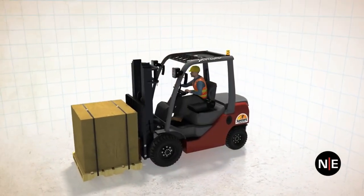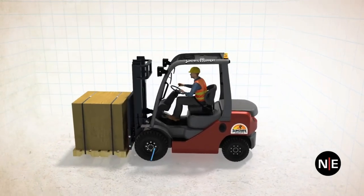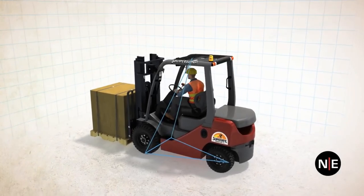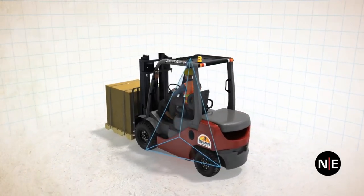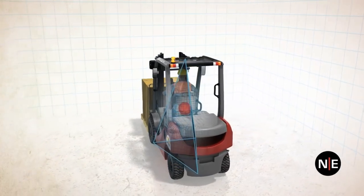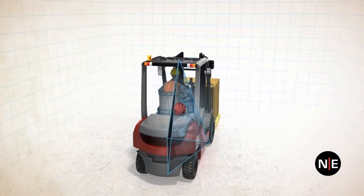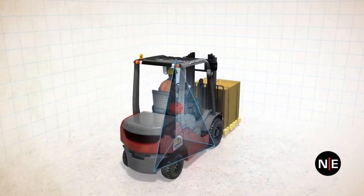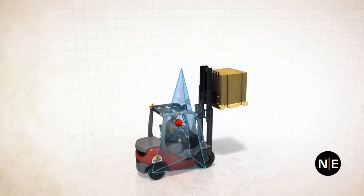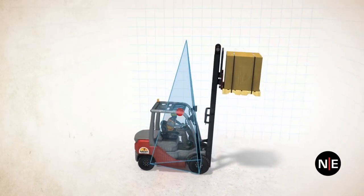The best way to visualize a forklift's stability is to create a stability pyramid. Start with the three points mentioned — the top point of the pyramid is located just above the operator's head, lined up with the top of the mast. Draw a line from each of the three original points to this new fourth point to create a stability pyramid. But that fourth point is not stationary; the stability pyramid grows taller, shrinks, and skews as the operator raises and lowers the load and adjusts the mast.